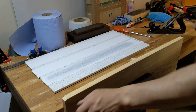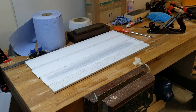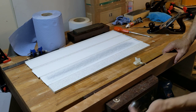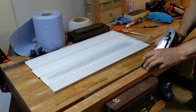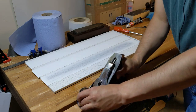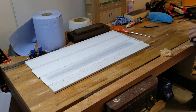Okay, so the pine. Really glassy, smooth, beautiful, no problem there at all. And then we'll get our stick of cherry. Again, different wood, different characteristics, so we'll just back the iron off a little bit. Adjust it for what we want, and that's what's so good about these planes. You can just back it off a touch. Oh, look at that, beautiful. Fantastic.